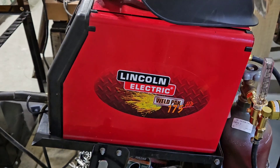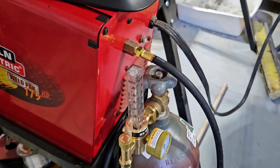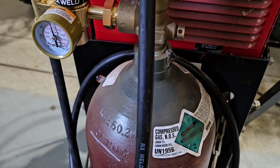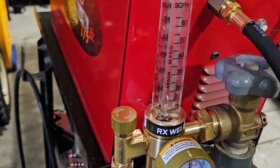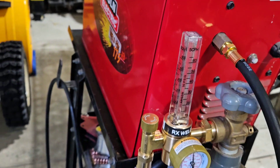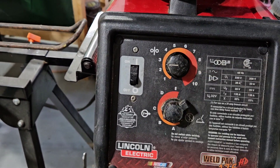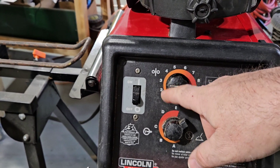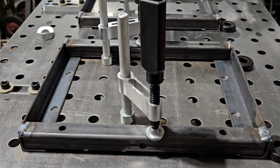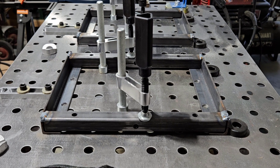Let me just show you my setup here. It's a Lincoln Electric Weld Pack 175 HD — not a very high-end welder, but it gets you going. I'm using compressed argon CO2 mix, set at 25 PSIG. Our other settings: whatever B is for voltage — I honestly didn't read the manual — and I've got the wire feed between 2 and 3, not very high. I'm going to weld up the outside of these and make a note of it so I remember to do that next time.